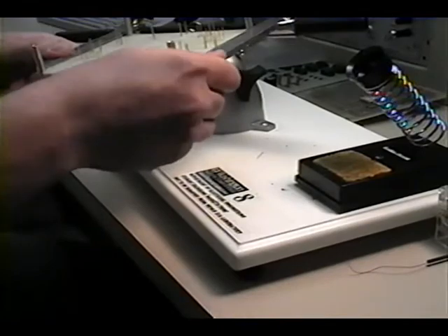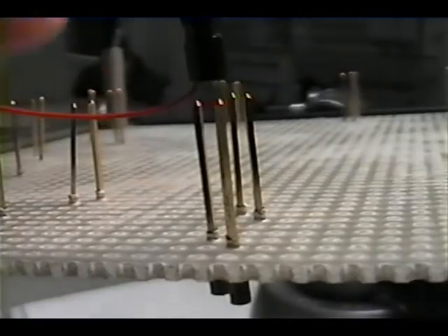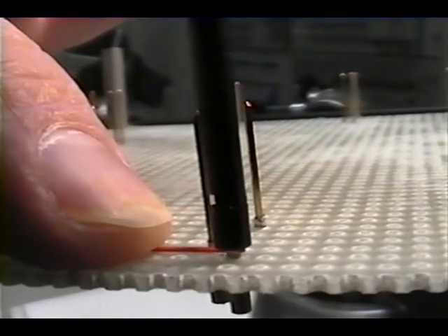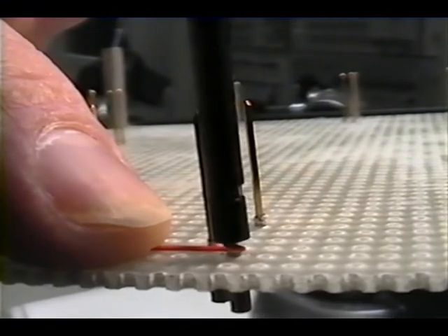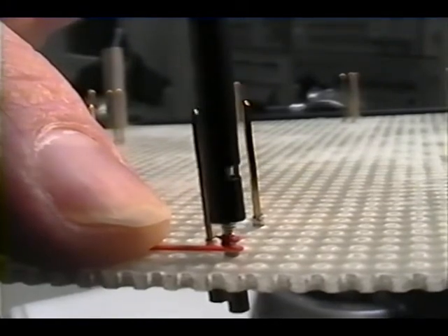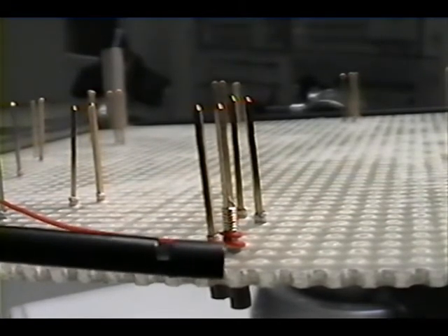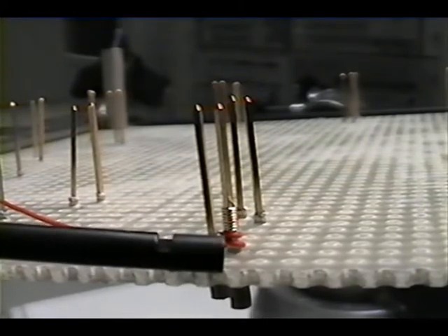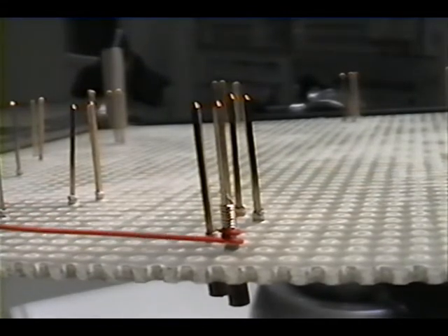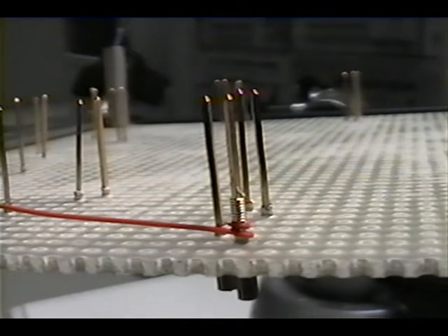If you have a fixture to hold your circuit board, we can provide those if you're interested. This fixture is designed for soldering but makes an excellent way of holding your board. The wire inserted in the tool is now being applied to the post. You allow the weight of the tool to rest on the wire wrap — just the weight of the tool; you do not need to push down. We're using the OK manufacturing tool, which produces a modified wrap. At the base of the modified wrap, you'll see one and a half turns of insulated wire around the post, then a perfect helix of conductive wire. The insulated wire acts as a strain relief so it doesn't get pulled off the post.